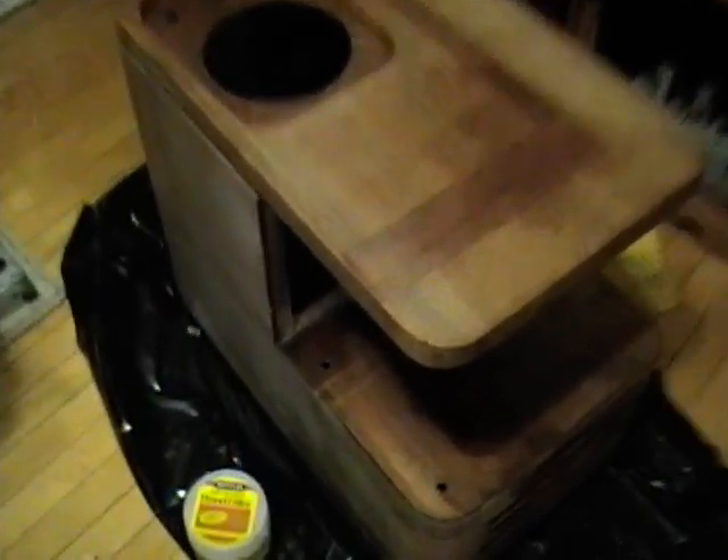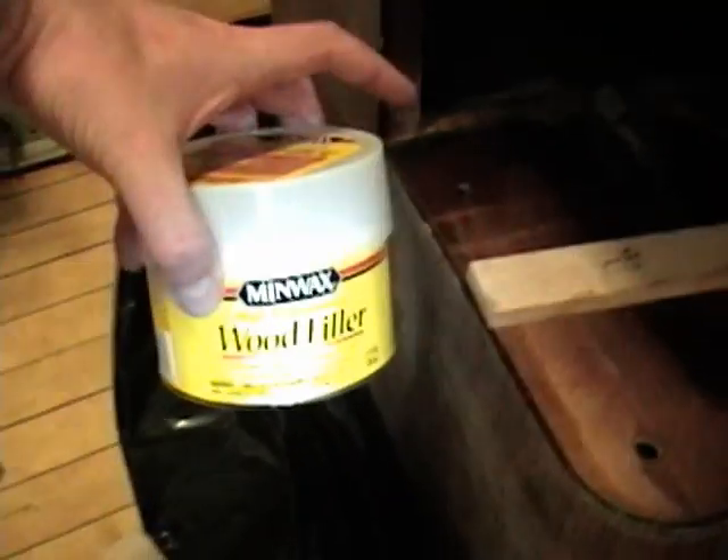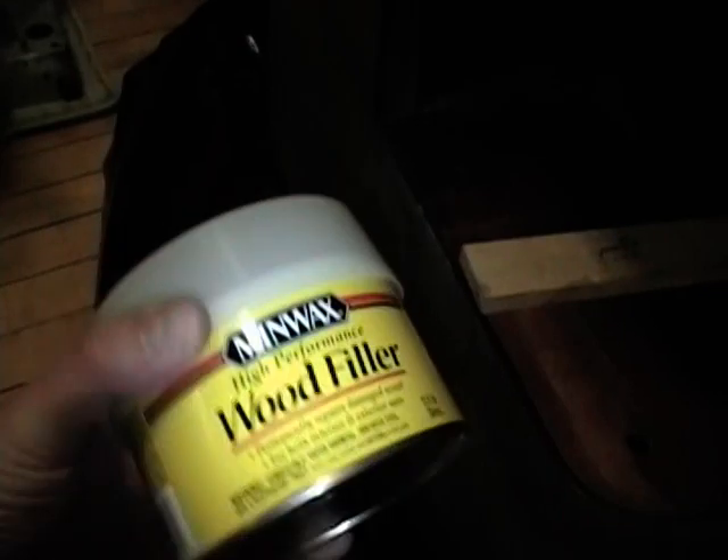I finished stripping down the cabinet, and now I want to try patching in this hole. I picked up some oak stock — it's a half inch by two inches. I'm going to cut some pieces that are wider than the hole and screw and glue them in from below. Then I'll also take some pieces and trace out the rough edges here and cut them out. So it'll be one piece spanning the bottom, and then I'll put the patch in on top of that. There'll be some gaps around the edges and this is slightly thinner than the original wood, so it'll be a little low. To fill that in, I'm going to try using this high-performance wood filler — kind of like Bondo for wood.